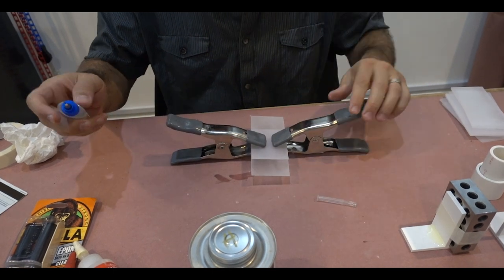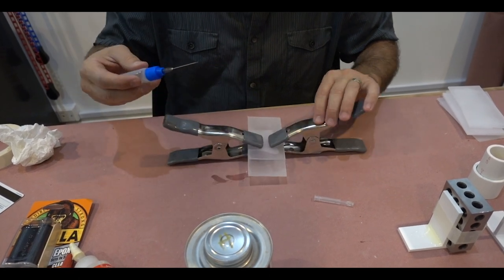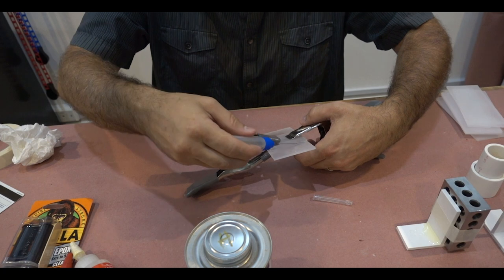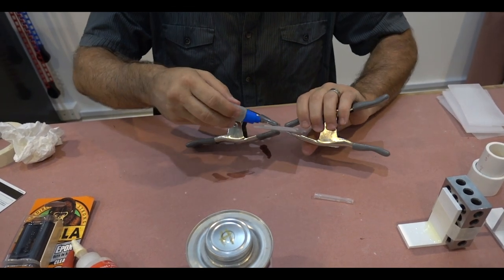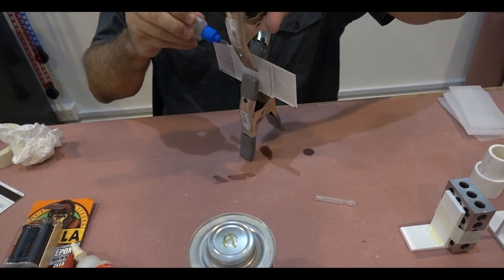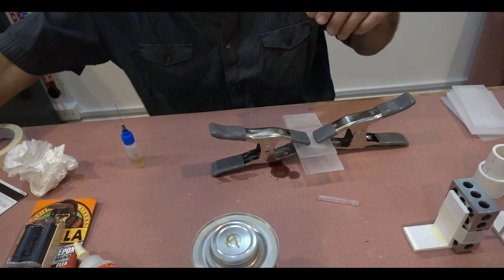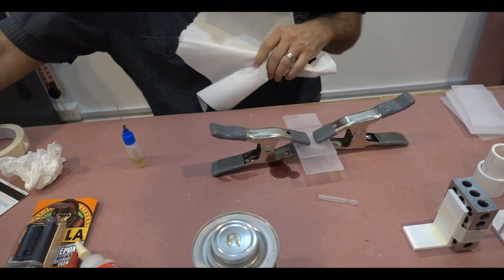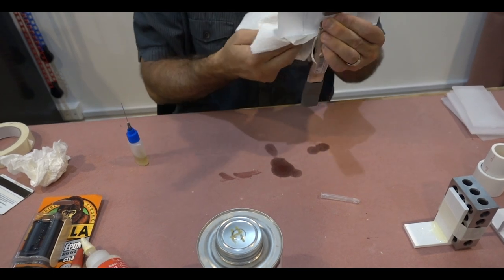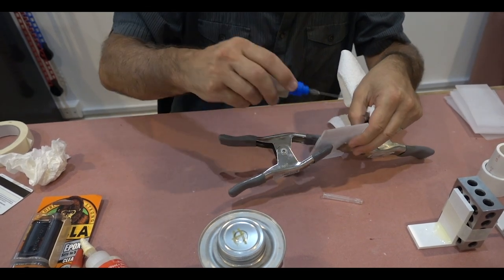Clamp these as tight and thoroughly as possible, then we're going to use the capillary effect — the wicking effect — to get the solvent to go in. I'll just use this applicator and be careful not to stab yourself; I've injected myself with so many solvents over the years it's amazing I haven't become some weird monster. You can see how that stuff is going under there. You might want to keep some paper towels ready and dry off any excess or drips as you go.